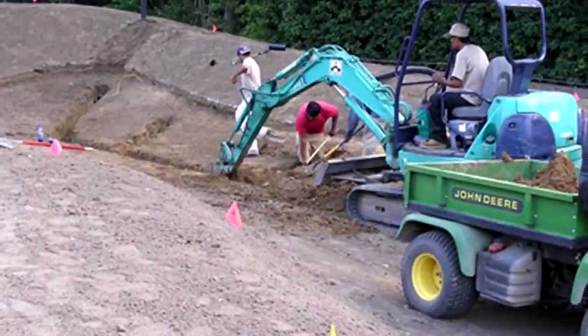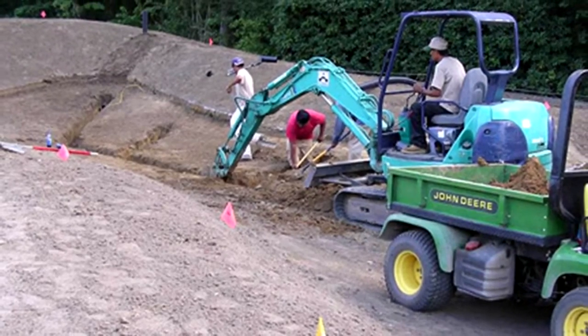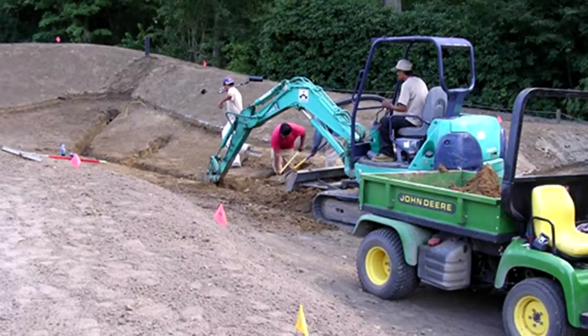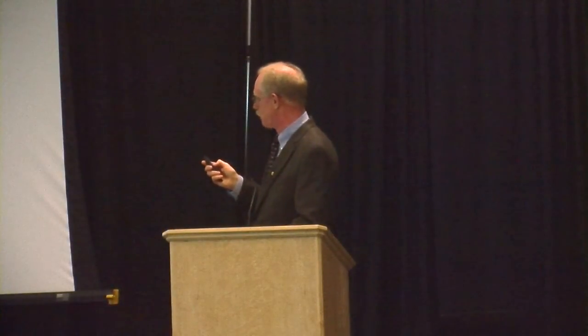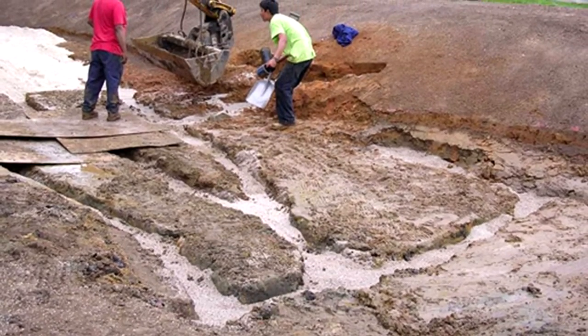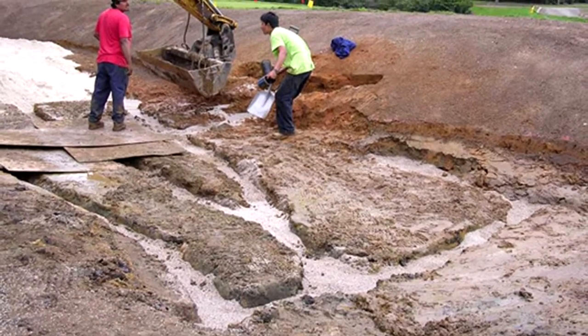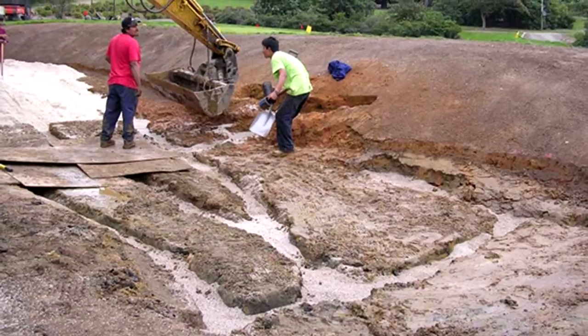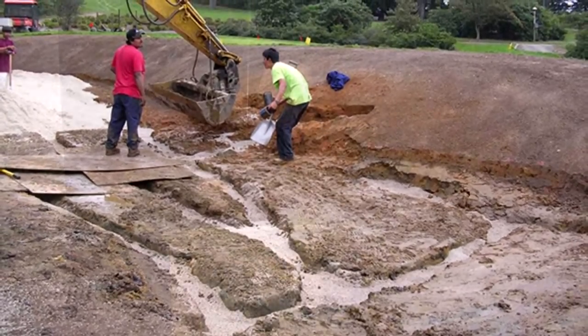The equipment that one uses is important. Ditch Witch doesn't work that well. If you really want your drain lines to be adequate, just get in there with a small hoe. You can see it doesn't take huge equipment, huge expense to get the drain lines cut in properly. And sometimes you may be in a big mucky mess. This is in South Jersey, in Haddonfield at Tavistock, and it's actually called liquid soil in spots in this course. A spring popping out from underneath the green had to be captured, not above the point as Ed said, but at the seepage area itself.